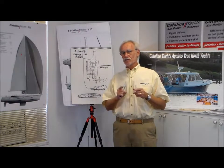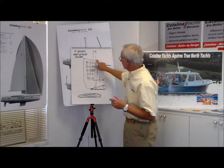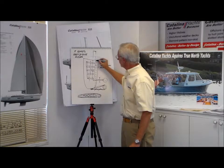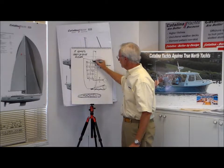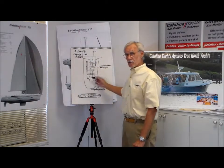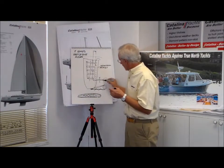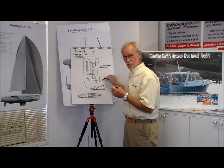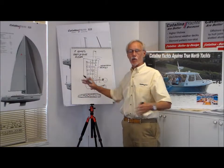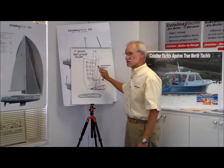Especially in freezing climates, if you ground the boat — just tap the bottom — and you don't have the core attached to the skin, you break that little bond at the top. All rudders are underwater, and once you make a little fissure there, water enters. Any void that's created immediately fills with water because hydraulic pressure fills it. Then you haul the boat, it goes through a couple of freeze-thaw cycles, each time expanding that crack and attacking that weldment. Those kinds of welds don't like to be encapsulated, especially trapped in water. Eventually the rudder will fail — with no exterior warning unless you see a little rust weeping out of the bottom of the blade, as you'll see in some older rudders. That doesn't happen to these rudders.